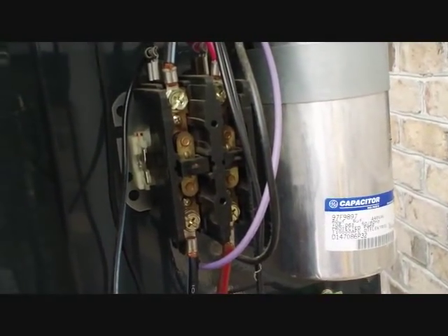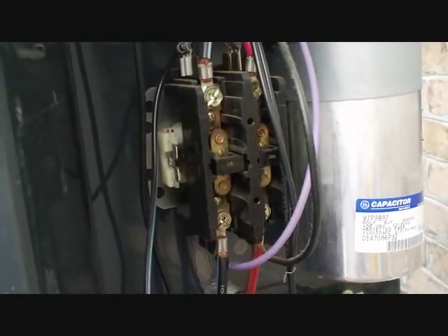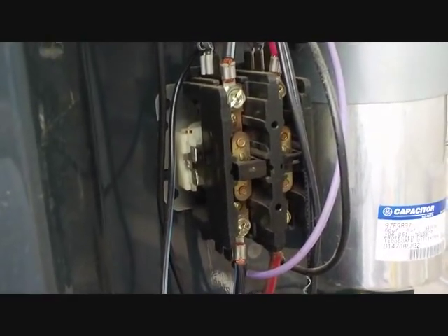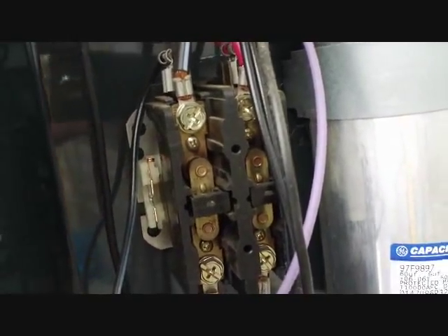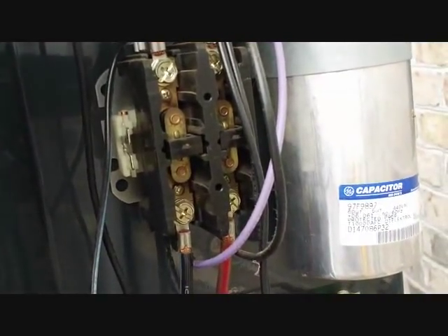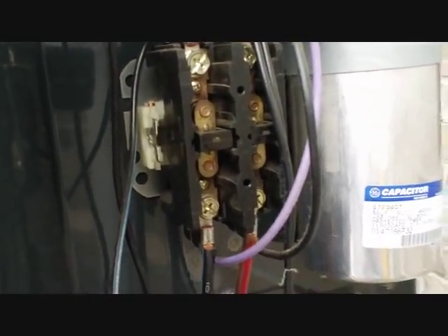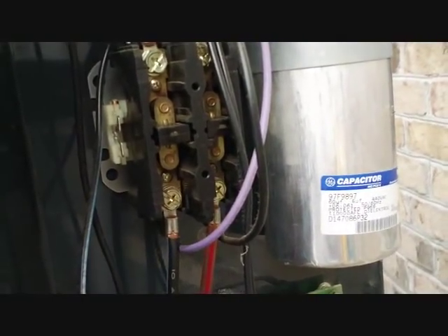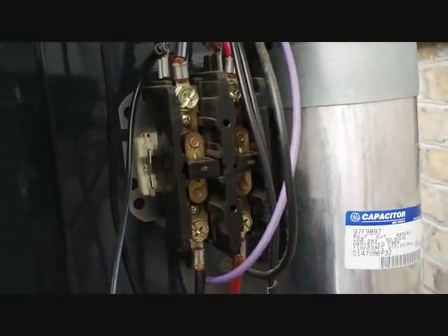Here's the four-ton unit I'm working on next to the other ton and a half which I'm recharging. Here's a good debate: the contactor coil rating — I like to see it above 10 ohms minimum. Most of the time they're 15 to 17 ohms, but this one was 11, just above 10. You can see visual signs where it's arced and there are burnt terminals, and it's burnt out on the terminal block. Do you change it out on PM? I'm going to go ahead and change it because this is what we're here for — to stop these things from happening at inopportune times. It's a good discussion to have, but to me this is preventative maintenance.